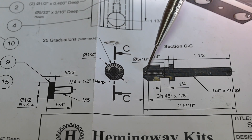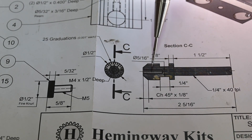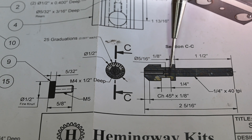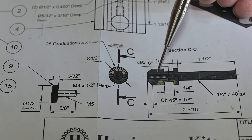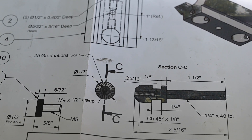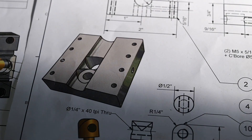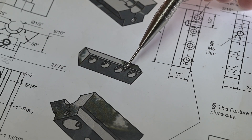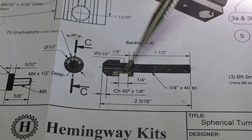It's a fairly straightforward turning procedure. And then we've got to find a way of marking up the end. This thread through the centre I believe is just for an Allen bolt, which you lock tight in, and which allows you to turn the lead screw to adjust the depth of the cut on the end of the cutter. So get that made today. Might make this nut as well, which is a little stop nut. It goes through there to lock the slide once you've set your measurement. So let's get over to the lathe and get this bit sorted.